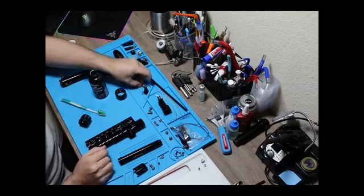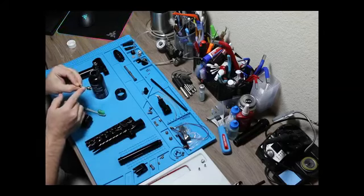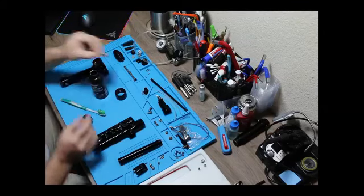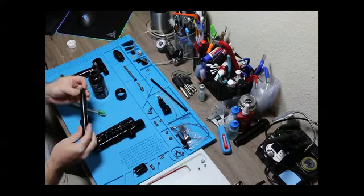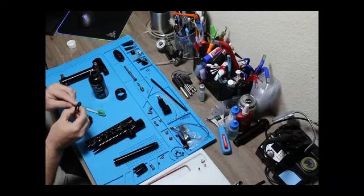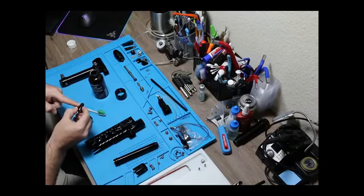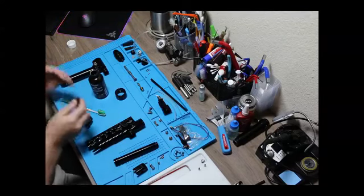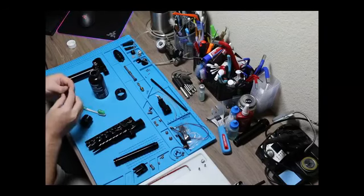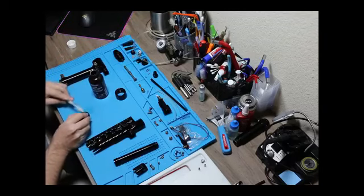Like I said, this Lurker valve is cool because it looks just like a normal valve, but there is a hole drilled through that goes to the back end. On these little rocket systems that they had for the ram sleeve, it would get caught, and there'd be a pressure that would cause a hydraulic lock. You would have a pressure set to here, and the atmospheric pressure would be here, and it would either A, create a vacuum, or B, force it shut. So what they did was they just balanced the valve, and they do that a lot on some of the new RT valves and stuff for Vikings and whatnot.